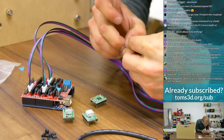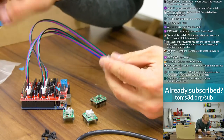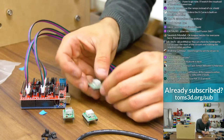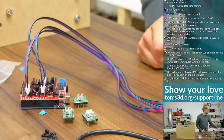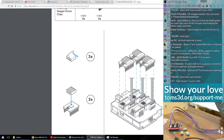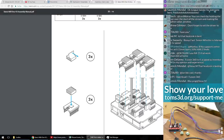So these come preset at the center position of the potentiometer. Again, you can't really set these stepper drivers to a fixed voltage, because they have different sense resistors. Some driver types have different reference voltage ranges that correspond to different currents. So you can't just set your drivers to 0.8 volts and have that as a universal configuration. So the potentiometer goes towards the jumpers.